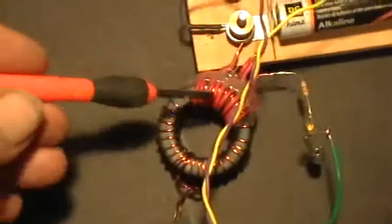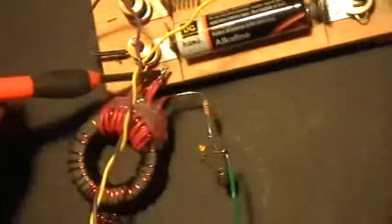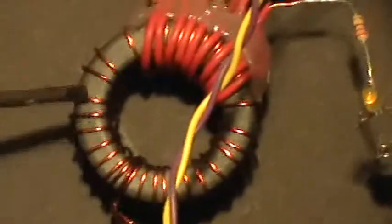The coil is a toroid that I had in my junk box. This is actually a configuration that I used to test some other oscillator arrangements, but it works pretty well for this purpose. There's 10 turns here, and that's actually got a center tap, but I'm not using the center tap. I'm just using the two ends of that 10-turn coil of number 22 insulated solid wire. And then here I've got a bunch of 30 turns or so of enameled copper magnet wire, and the two ends of that coil come out here into this little connector.